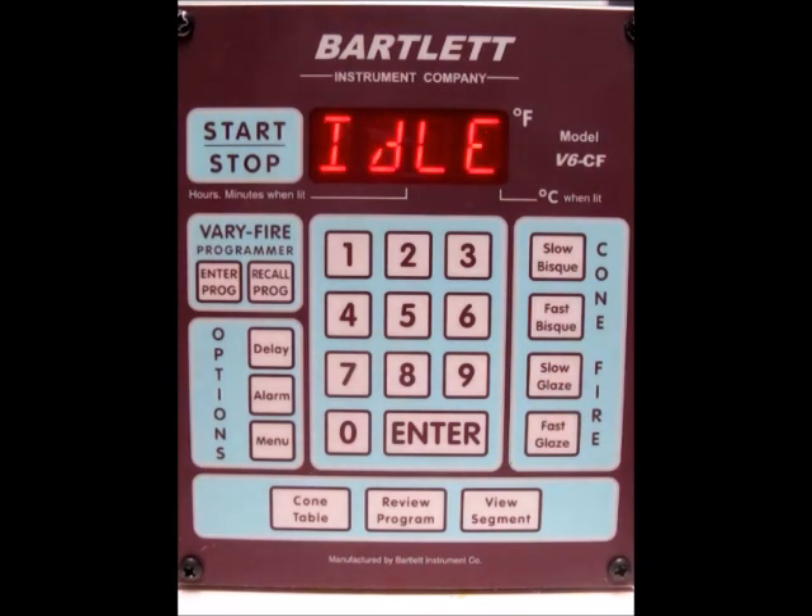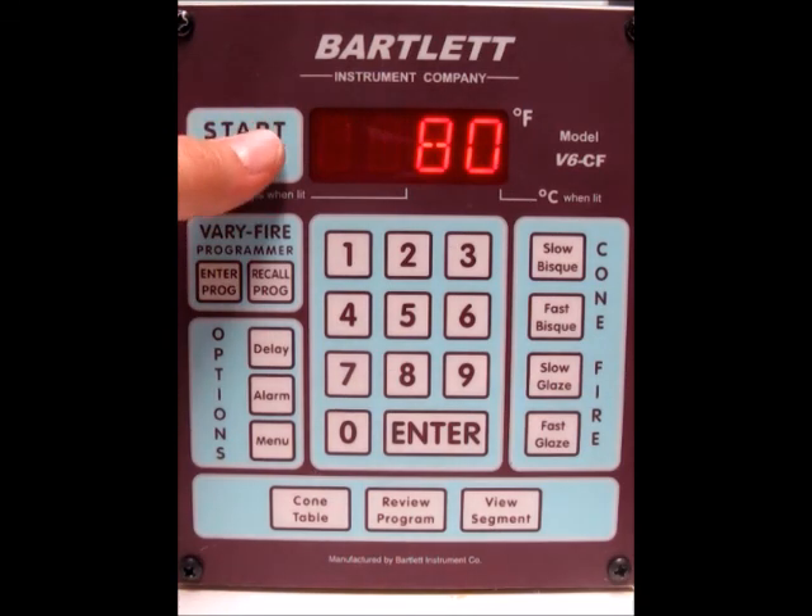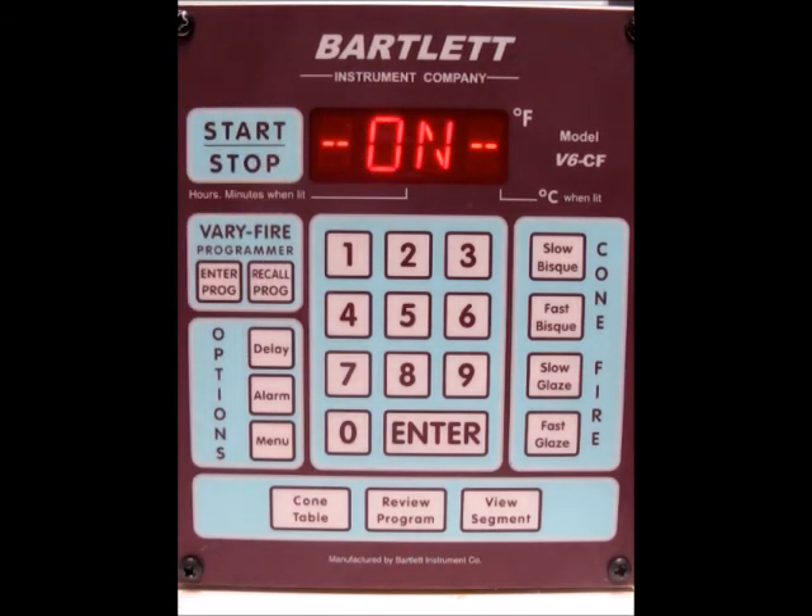It'll go to complete, and now with the lid open and the kiln completely empty, go ahead and press Start — the kiln should turn on. Run this test for about 20 to 25 minutes, then observe the elements all the way around the kiln to see that they are all evenly lit.